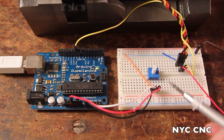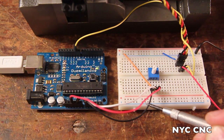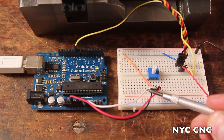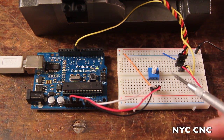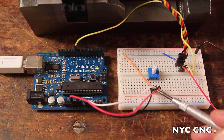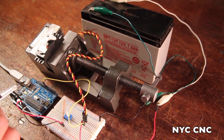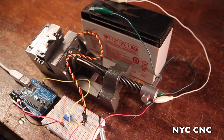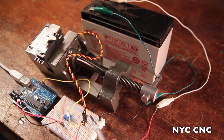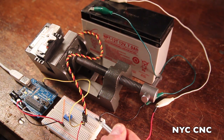Let's take a look at the board. The potentiometer has three leads. The left lead is connected via this black jumper wire to Arduino ground. The middle lead is connected via this white jumper wire to analog pin 0. And the right lead is connected via a red jumper wire to 5 volts on Arduino. The yellow pin on the servo is connected via this yellow jumper cable to digital pin 9. The red pin on the servo is connected via this red jumper cable directly to the battery's positive voltage. The black pin is connected via this blue jumper cable to the ground rail on the breadboard.